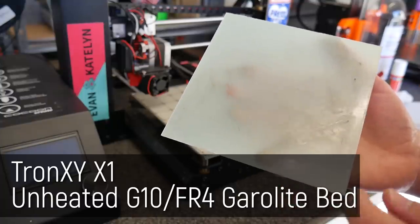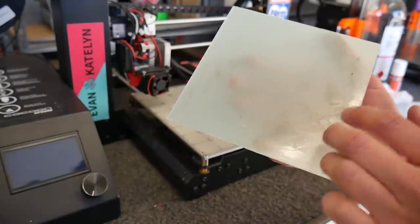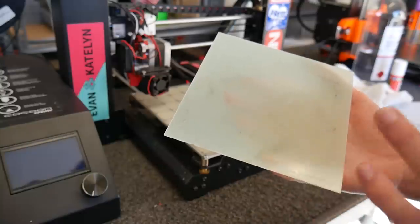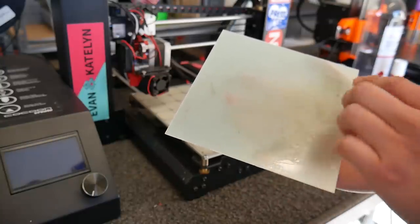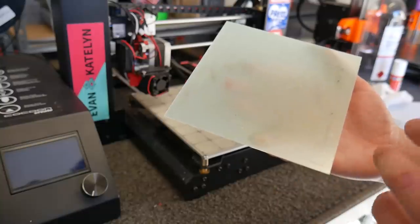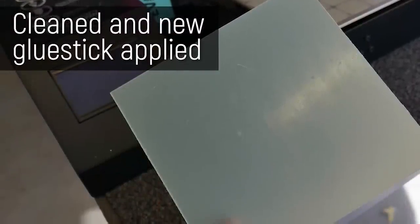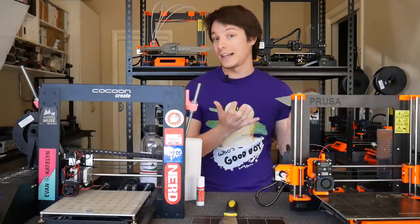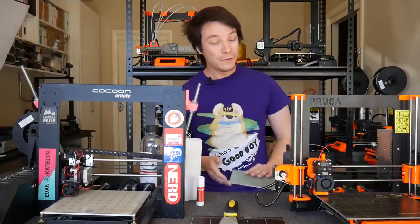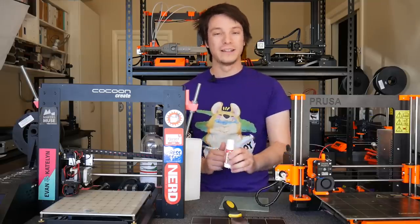This is the print surface for the TronXY X1 and it has a non-heated print surface, which means you generally need some sort of bed adhesion additive like glue stick. As you can see here, it builds up after a while to a really gross sort of first layer. Again you can use solvent and a scraper blade to scrape this back, but you will need a lot more glue stick on this than you would on the Prusa PEI surfaces, because they warm up and the heat helps things adhere. This also applies to unheated print beds with glass — you really do need more glue stick. But if your print bed is heated even to just 45 degrees Celsius or so, you only need a tiny bit of glue stick if anything to give that first layer a really good shot.